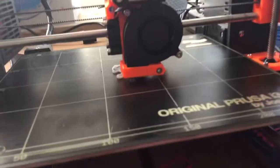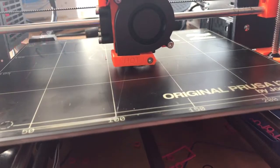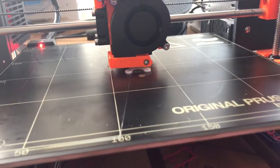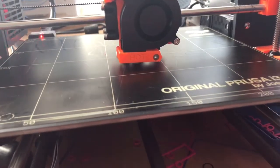This is my first attempt with flexible filament. And it's printing actually pretty well. I'm printing the dog on the SD card, and I'm printing probably around 50mm per second. It's actually working pretty well.